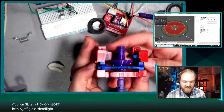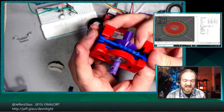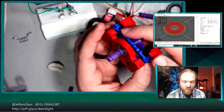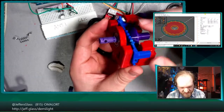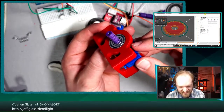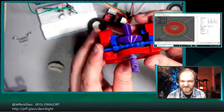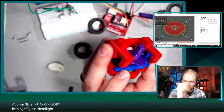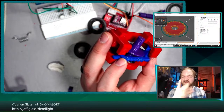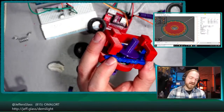Many, it turns out, are specifically AC relays in that they're triac controlled. And as we all know, the wonderful thing about triacs is that they only turn off when there is a cessation of current, when current goes to 0. That's the whole point of a triac's function. You turn it on with an impulse of voltage on the control side, and it only opens when the voltage drops to 0 across the load. And that's, of course, not what we want.